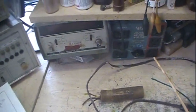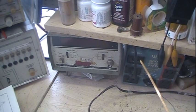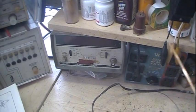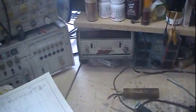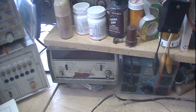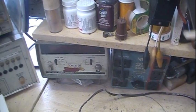So you can have a one-to-one transformer where the secondary is wound with a couple gauges of smaller wire than the primary, but they're still wound so that the transformer has a one-to-one turns ratio — the resistances would just be different. In this case it actually works out even, but I have seen some where the primary was around four or five ohms and the secondary was around two or three ohms, and I've seen them the opposite of that — just the reverse.